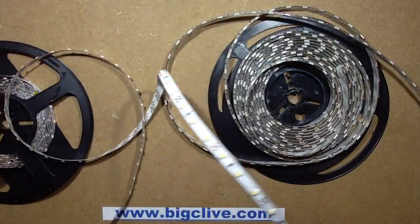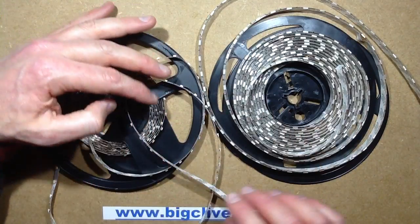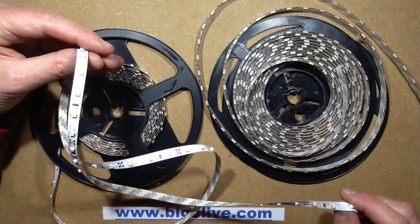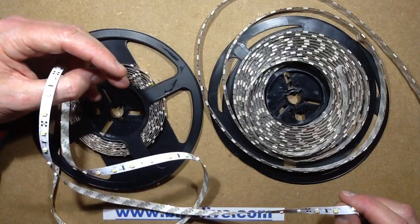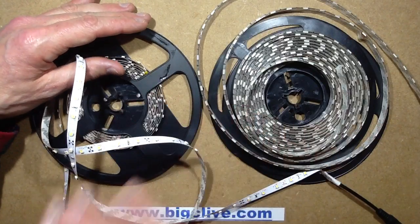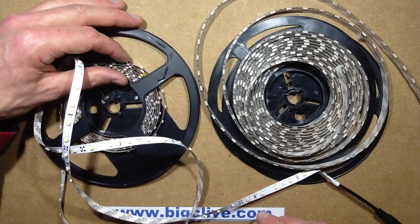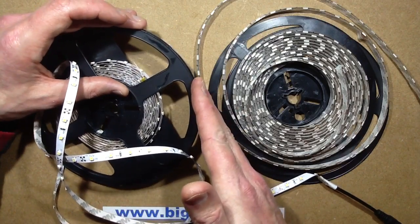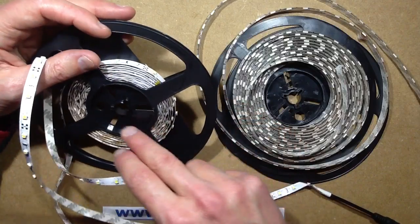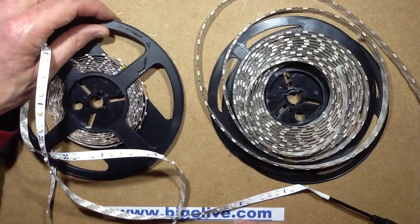The reason for that is because there's actually quite a high voltage drop from one end of this tape to the other. I measured it over just one meter, and the voltage drop per meter was 0.35 volts. If you multiply that by 5 — which isn't fully accurate because the voltage drop will get lower and lower as it goes along since the current is also reducing — it would theoretically be 1.75 volts less at the far end. With the same 150 ohm resistor, the LEDs at the very end of the run would just be getting 5 milliamps each.